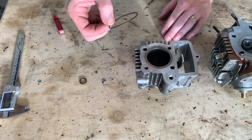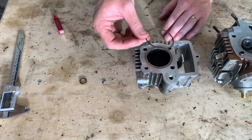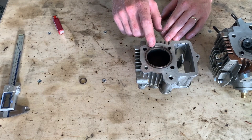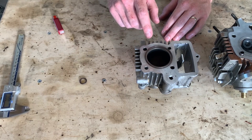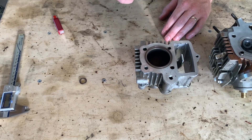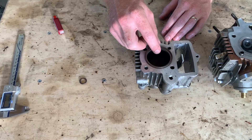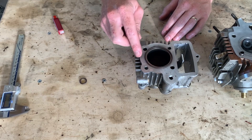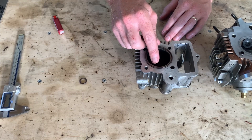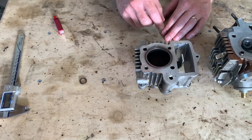This is a 51 millimeter o-ring, two millimeters thick, and it's going to go on here. The groove is going to measure 2.8 millimeters wide and 1.68 millimeters deep. I am going to stretch the o-ring by about two percent, and that should give us about two and a half millimeters standoff from the cylinder bore.